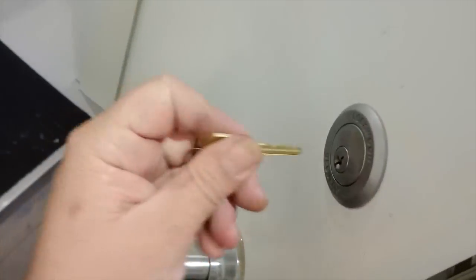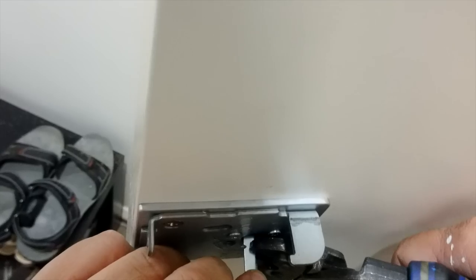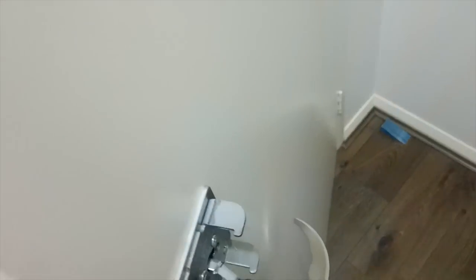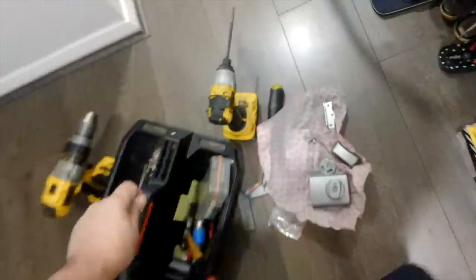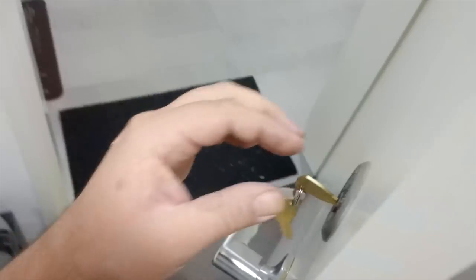Four screws in. Now you need the keys and the side cutters. So just checking it looks good up front, yes. Keys in, rotate it. Now we're doing a couple of millimeters, so give it a nip. Turn around, give it a nip. Let me measure that. I normally cut that about 5mm. That's about 5mm. It shouldn't protrude through here.